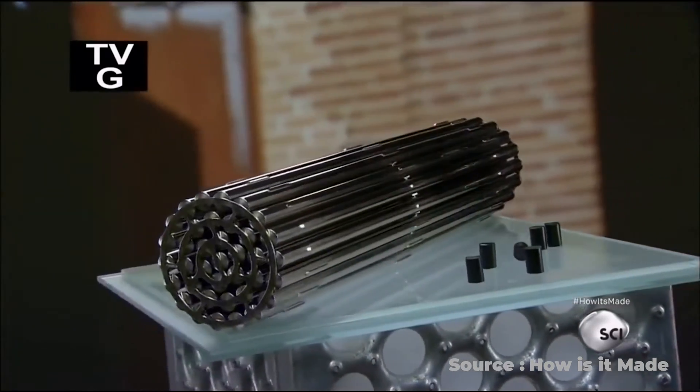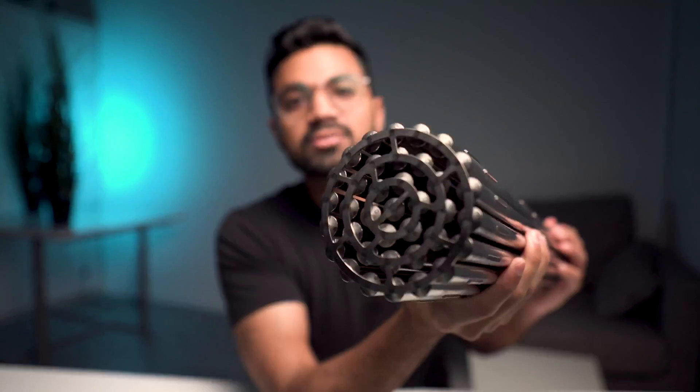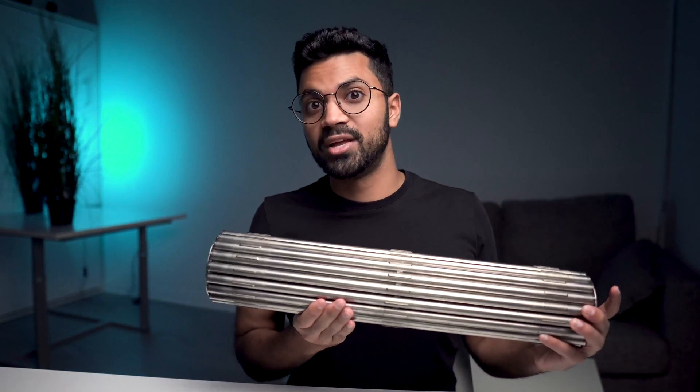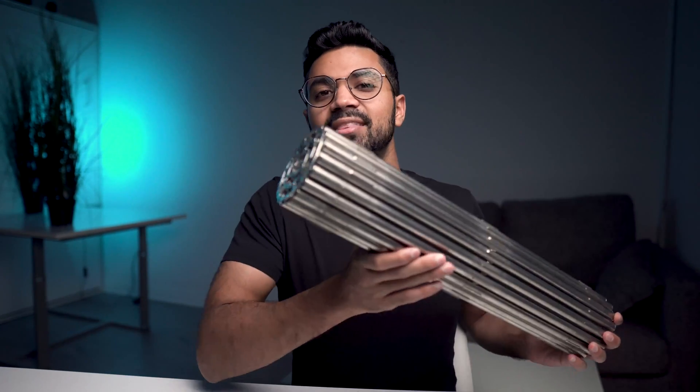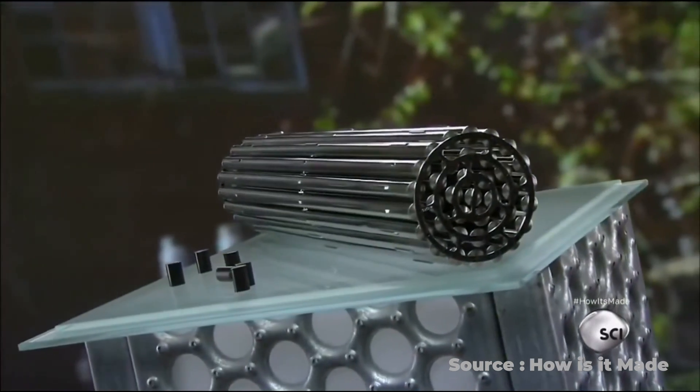The metal that you see on the outside is called a sheath — like a sword. In the United States, we call this cladding. It's called a sheath because it's sheathing the uranium fuel kept inside, which is going to be super hot. You'll see that this thing is fully sealed, so once it goes into the reactor it doesn't crack open — it remains sealed from beginning to end, whether it's a fresh fuel bundle operating or once it becomes nuclear waste. This bundle also holds hundreds of fuel pellets, around the size of an earplug or a Canadian quarter.